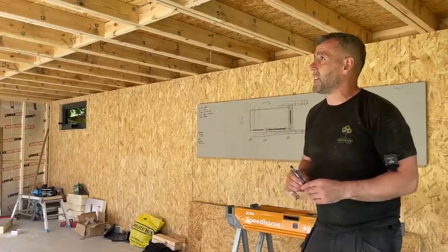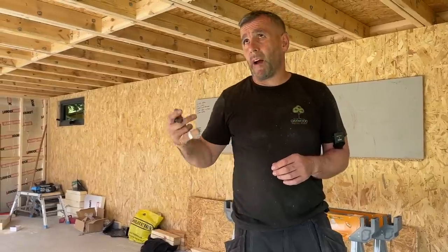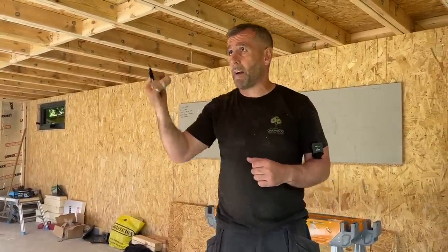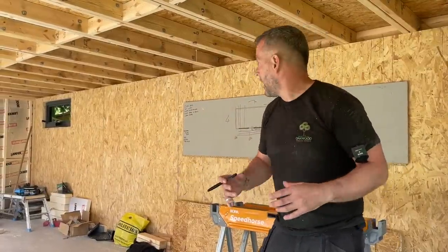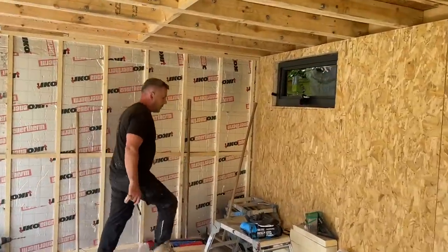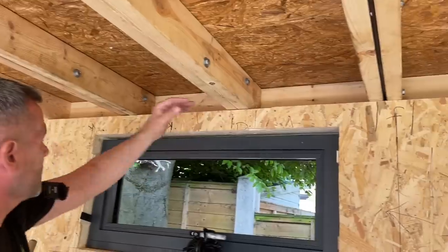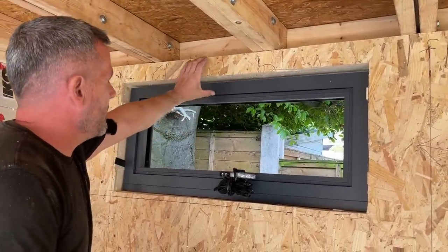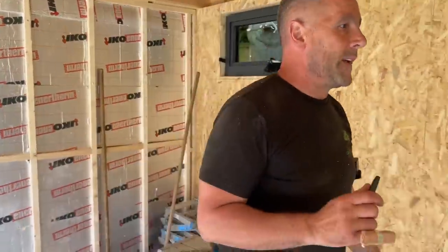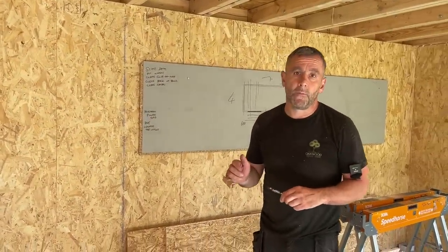You can see the work that's gone into this structure, but you can guarantee it will remain like this for the rest of its life. That is your flitch beams, your big roof span, your double timbers bolted together, your stud wall bolted together with OSB both sides to structurally support that roof weight. There is no risk of that building crumpling or collapsing. That's the biggest build you can do under permitted development without any planning permission whatsoever.